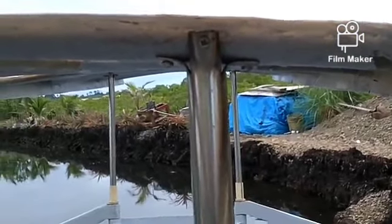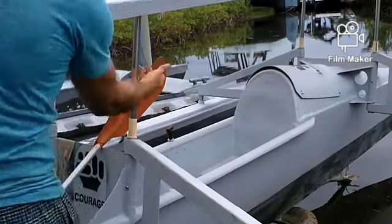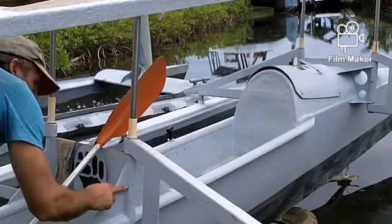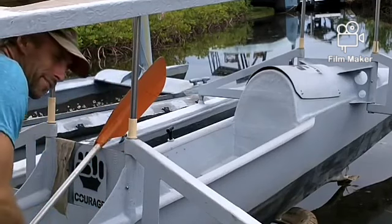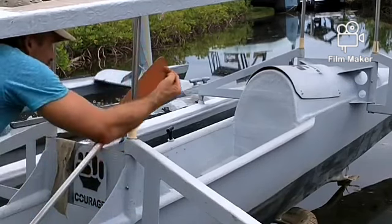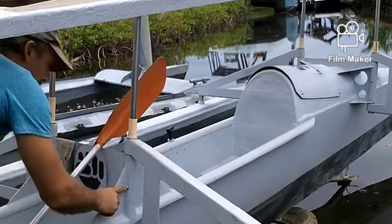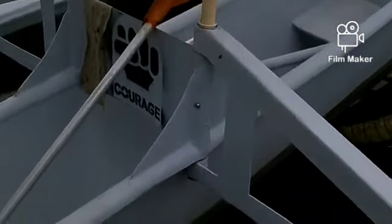Got those screwed in. I'll still probably rivet it eventually. It's nice having solar panels riveted in because they're harder to steal. And then put bolts through all these, after getting it all lined up level, which was a fun-filled half an hour of going over there, looking straight down the thing, coming over here, adjusting a little bit, going back over there and repeat. To get the threads for these screws, I happened to have some matching self-drilling screws that were not stainless, so I just screwed those in and pulled them out, and then put in these stainless screws here.